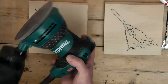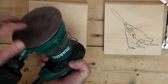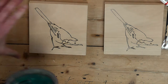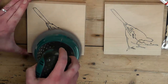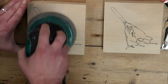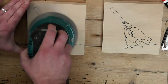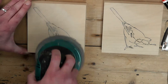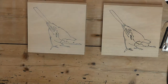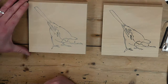We've got a little Makita random orbit sander here, 240 grit on the abrasive. This is the Abranet - really good. It's all perforated so any dust tends to go back up into the machine, or if you've got an extractor fitted, straight up the extractor. The kind of burn has gone under the surface so we can sand this back without sanding off our project. Just a quick buzz with a very fine abrasive, and that will get rid of all our little bits of carbon paper.